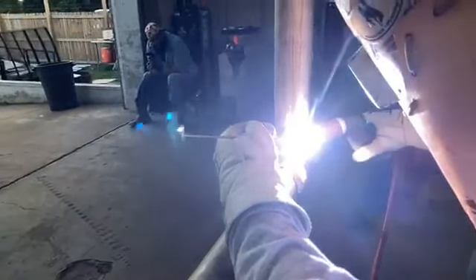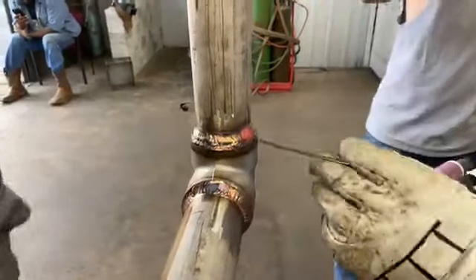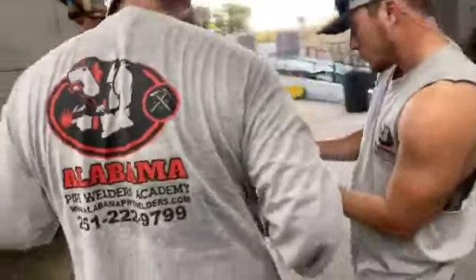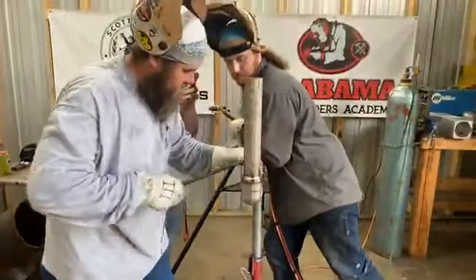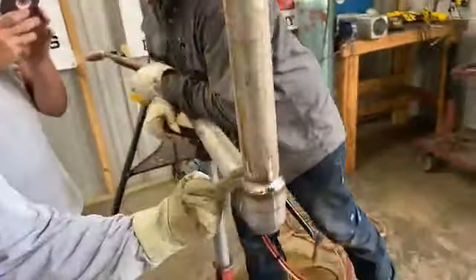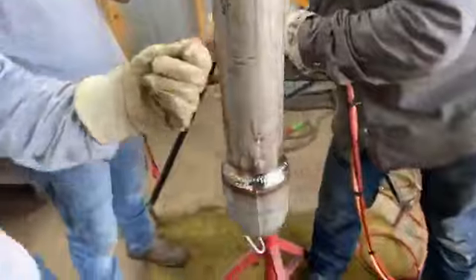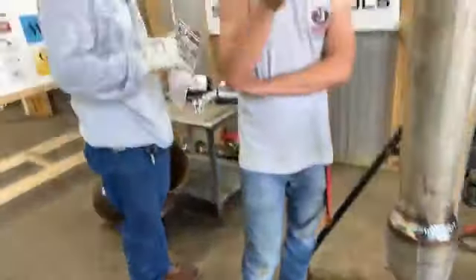All right, I'm gonna go ahead and get ready to terminate this weld. All I did was just kind of build it up a little bit before I was ready to stop — it sticks up a little bit and I can file it. Hold the pipe — that way you're filing what's built up around it and you're not hitting any of the weld before or after it. You built up a little bit before you terminated, cooled the puddle down, and left a little mound there that you can file down.